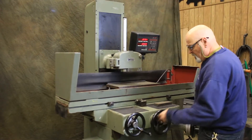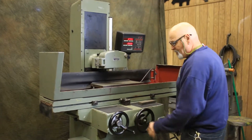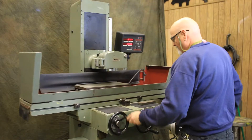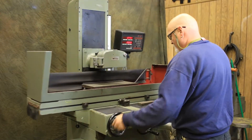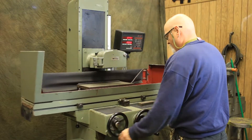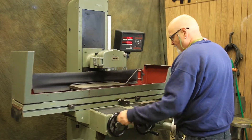The cross-feed has a new screw and nut in there, so there's no backlash at all. Here's your longitudinal table — it's got a little lock under here. The machine is just sitting on wood, it's not level, but as you can see it moves fine, very fine. It drifts a little because it's not level.